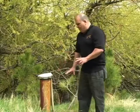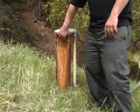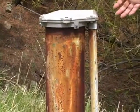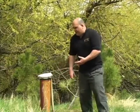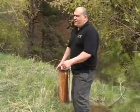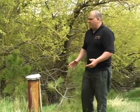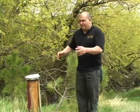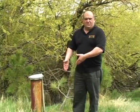A couple of things we look at first when we're outside is, of course, the cap. This cap is a sanitary cap — I know this because I've peaked up underneath it and it does have a rubber gasket. I can also tell that there's a positive flow of water; the static level of the water has come up the casing and is actually trickling out the side of the casing through a drill hole. A couple of other things we look at while examining the wellhead is the pitch and roll of the land. We don't want a situation where the area directly around the wellhead is pitched in such a way that runoff can gather around the casing and trickle down into the water table and aquifer.